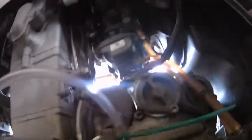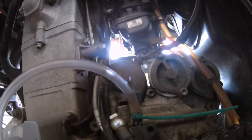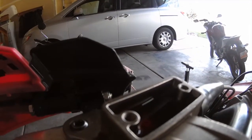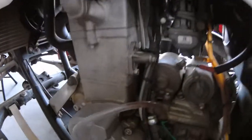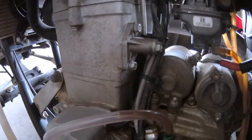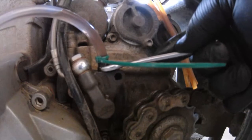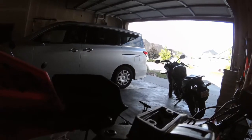And so that's what we got right there. We got fluid starting to come out of it, and I imagine if I squeeze like this, it'll make more and more of that come out. Now you need to be controlled because this is going to be going down here with every squeeze, so we're going to need to add some more in eventually. There she goes. When you think you got it bled, tighten it back clockwise. I can feel some pressure building.